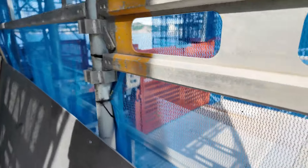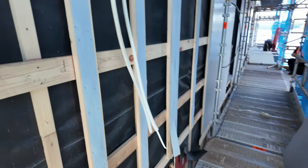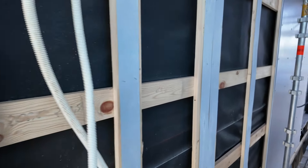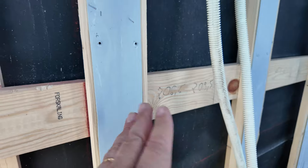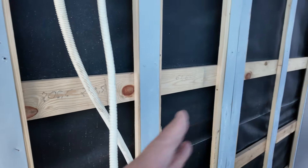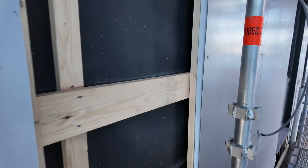Bear with me because I'm walking on scaffolding here. You can see this is a panel that's already pre-drilled — you see all the holes — and this will also give you kind of a section view of what we're looking at. Here's that full rain screen system, that piece that gets put up where the joints fall, and then these are spaced accordingly to where the panels go.